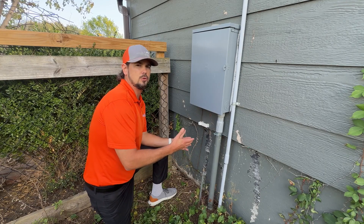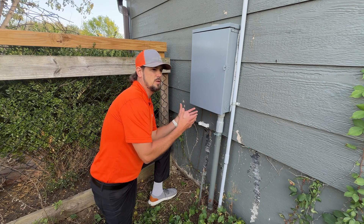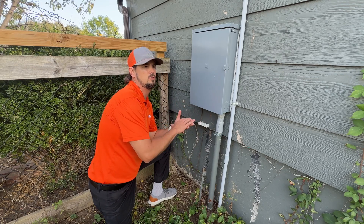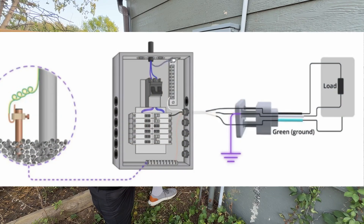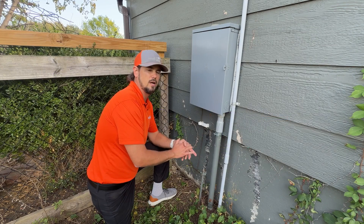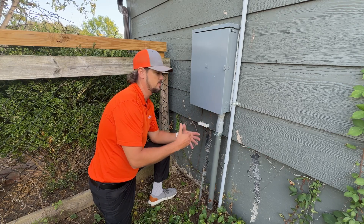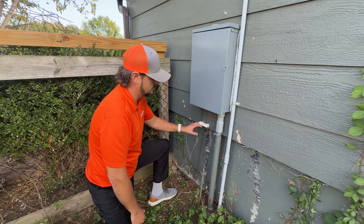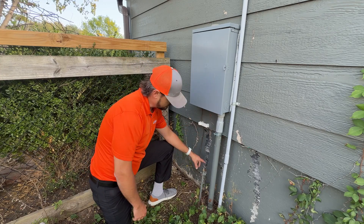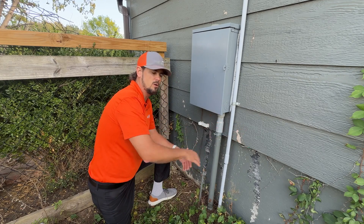The first thing we need to do is make sure that you have a good grounding system. The surge protection device actually works by shedding all the loads onto the ground, so without a good grounding system, your surge protection device won't actually do anything. We need to find out first if you have good grounding before you even invest in a surge protection device. We've already looked at this one — we've got a good ground out here, a bonding bridge, a good ground rod. It could be scuffed a little bit because it's painted, but it's all right. We have a ground inside of the water meter already, so we know we're good to go.